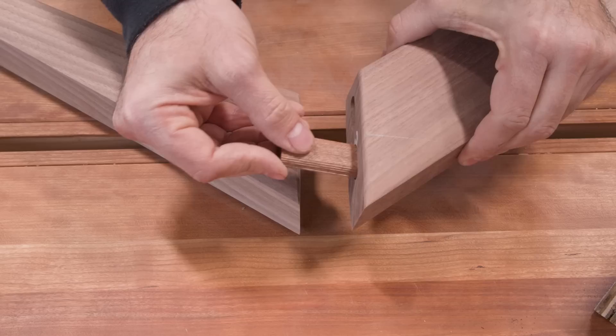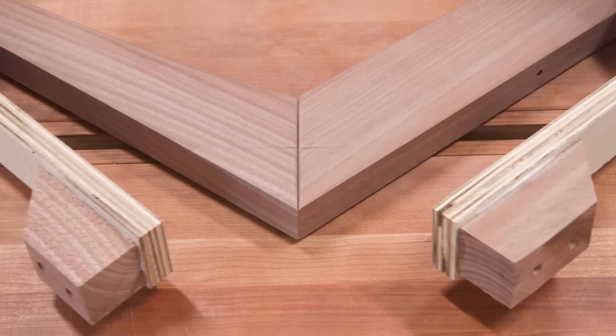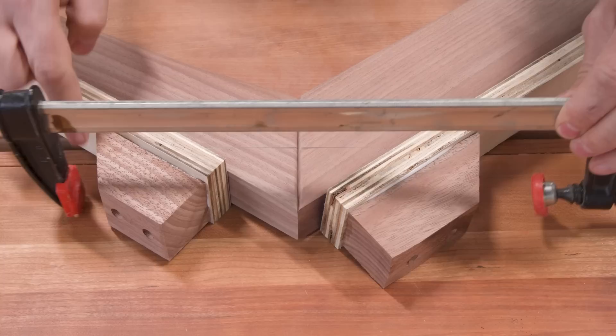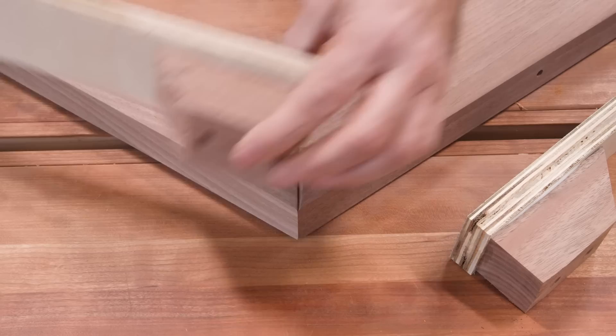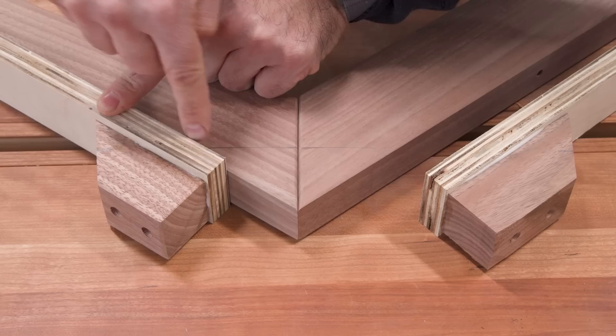Since this is not just a butt joint, I'm going to add my dominoes here and bring the joint together. To find the position of the strips, I'm looking to extend this line across to the center point of the clamp — roughly centered somewhere on the block. These angles were cut at 45 degrees, so unless the outside angle is 90 degrees it won't interface perfectly with the surface, but it'll be close enough. I'm lining up my center points with these lines here just by eye.